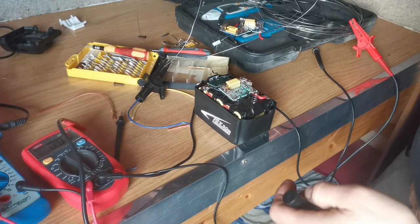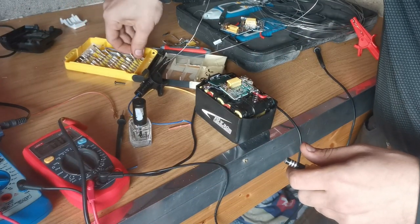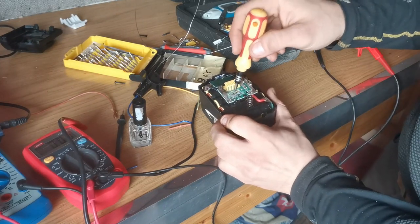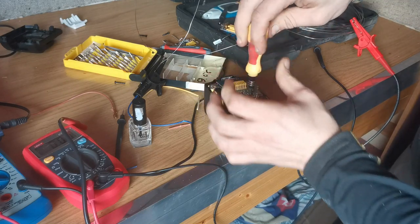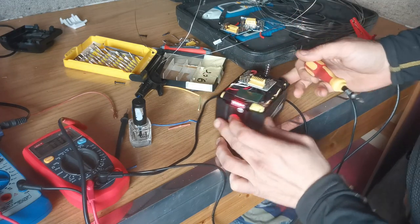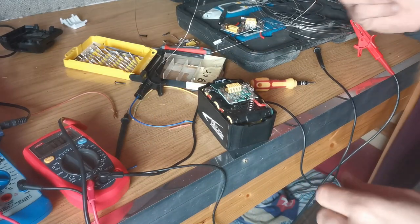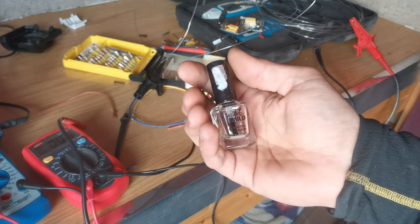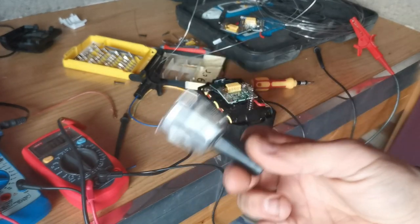One extra modification that I wanted to show you is, as the board isn't waterproofed, if any moisture gets between any of those components, it will fry the board. So this board is live, as you can see, and the best way to waterproof, and the easiest, simplest and most cost effective, is to use clear, it's important, clear nail polish.